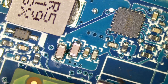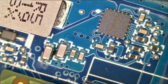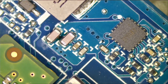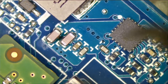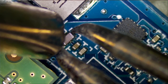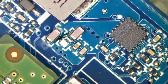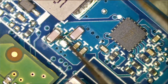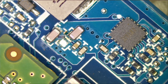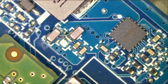The thermal camera showed heat in this particular area, both front and back of the board. Thinking logically, the problem is either those two caps or this IC. Since it's a lot easier working with caps, let's remove them one by one. I'm using my hot tweezers along with hot air. Let's put cap one on the side and measure — do we still have a short? This burnt flux here does not look healthy. Meter in diode mode — we still have a short.